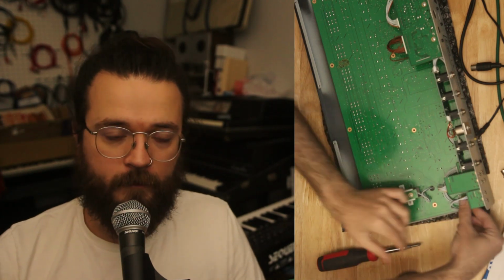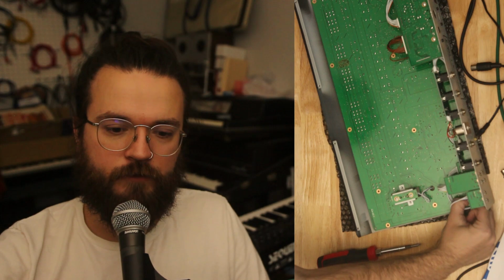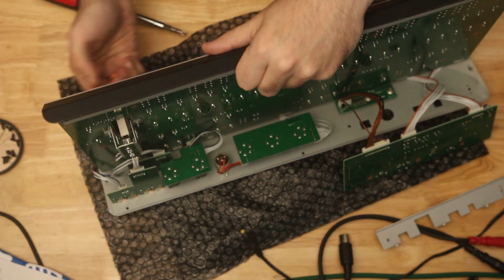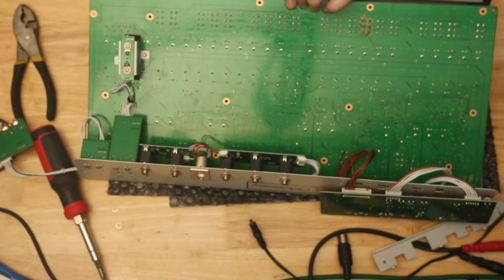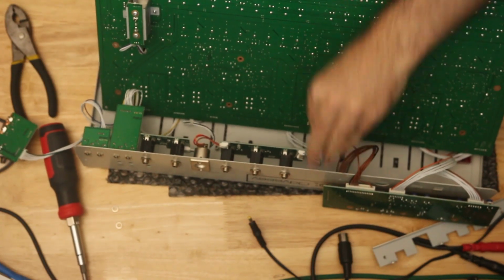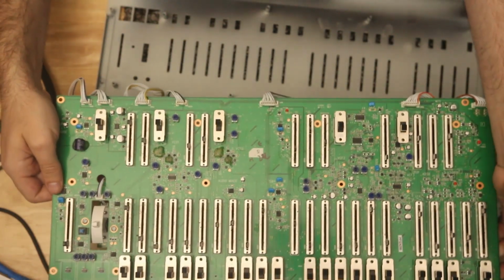Anyway, I got that whole main board. It's pretty much just one big circuit board. Free and released, you need to take all the buttons off, or the switch caps off from the other side, and then carefully pull out before you pull up. And once that's free, maybe another ribbon cable, and then I fold it over the top, and all the sections are labeled. Even if they weren't, you could go right to where the fader was for whatever section of the synth you're really interested in.